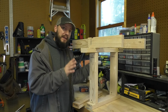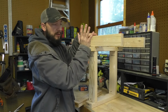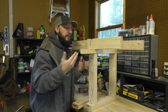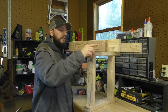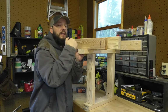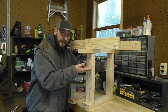First, identifying if you have a load-bearing wall or not. In most cases, if you open up the ceiling, you'll see that the ceiling joists or the floor joists will go like this and overlap right here, and they're attached. Sometimes they just butt together in older houses, and sometimes you could still have a load-bearing wall even if the ceiling joist goes all the way across like this, because this could be undersized and you actually need that wall so it doesn't sag.